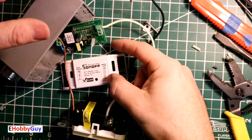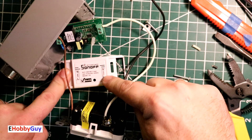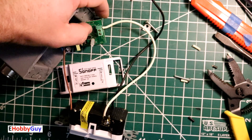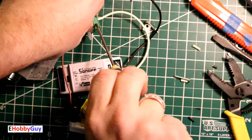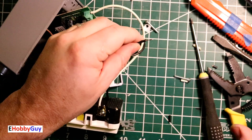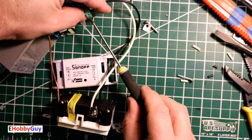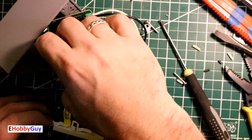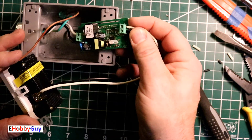So I just brought the Sonoff housing here — just double check: input side is over here, output side is here, neutral is the top terminal. White is neutral and I'm going to put that into the top terminal — just pushed it in, still have to tighten it down. This will have to be taped up to insulate it from everything. The live wire here — now before I wrap this whole thing up we'll give it some power and get the Sonoff active. I will wrap this in tape first since we've got high voltage here and we'll get back.